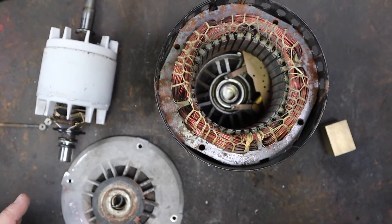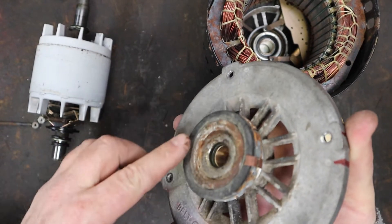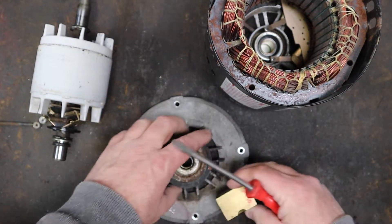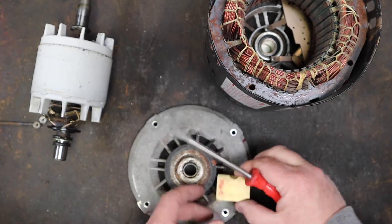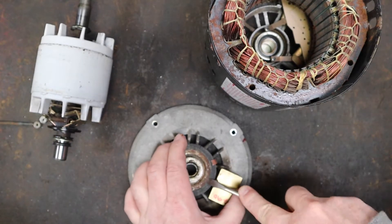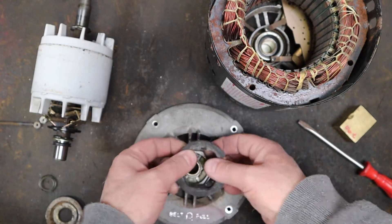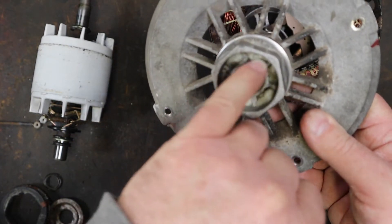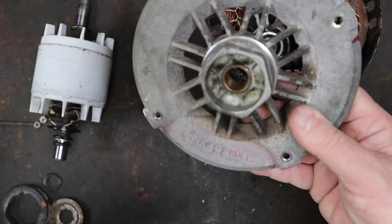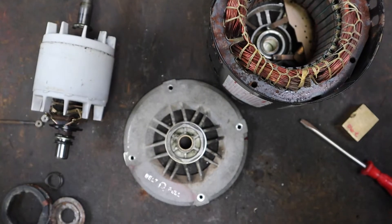It's pretty simple, pretty easy, pretty straightforward. Getting these motor mounts off is pretty easy. We have to take out this little pressed-in disc in order to be able to get the bearing out, and getting those off is a piece of cake — just a little block to use as a fulcrum. These just pop right out, boom, like that. There's your old bearing, there's your old felt — your felt is all soaked with oil. This pops off and we'll put it on the lathe, bore out the bore, press out this bearing, bore out the bore, press in the new bearing, and then we'll put new cotton into it.